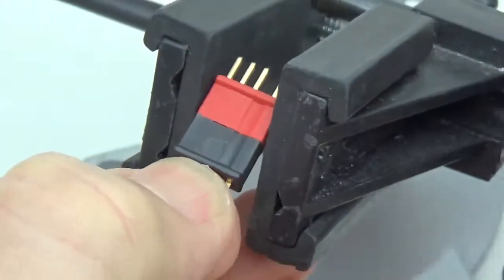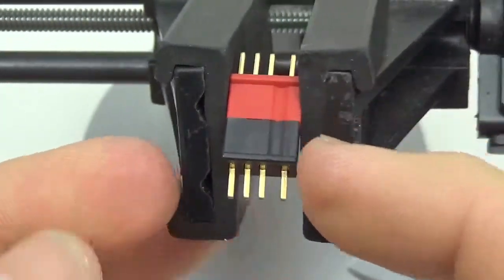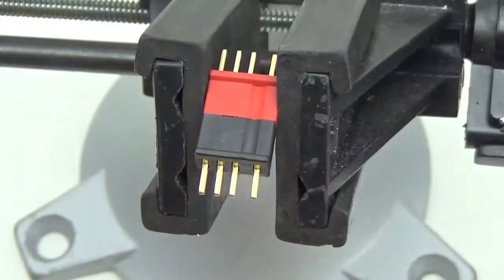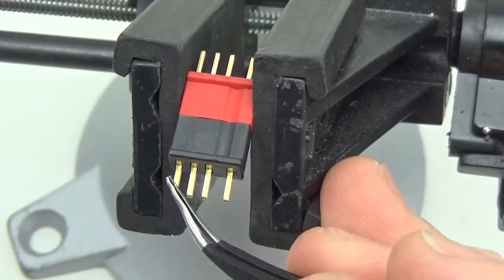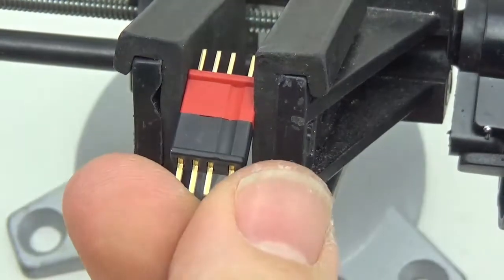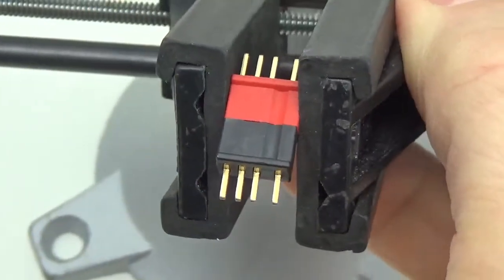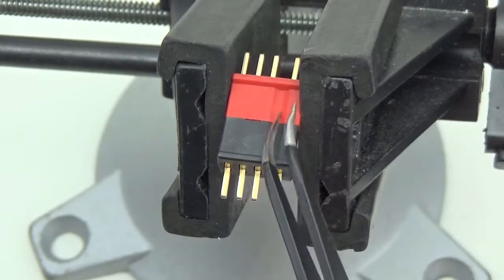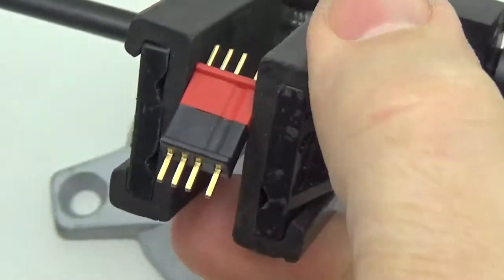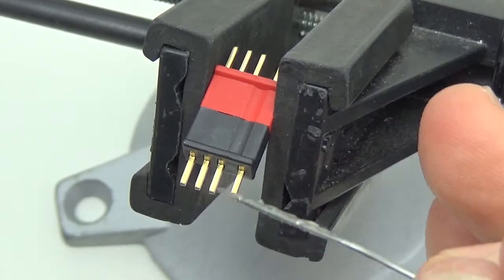The space is really, really important because that keys the connector so that it can't be connected in reverse. Because if you had power over here and ground over here, and you flipped the connector by accident, you could fry your sensors and do various other bad things. And so having a connector that's keyed like that, it can only be plugged in one way. Very, very useful feature. Some connectors don't have that, and as I said, you can accidentally get them reversed.